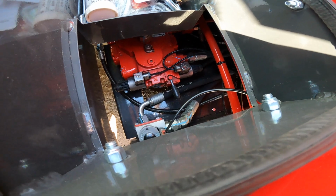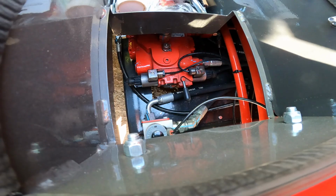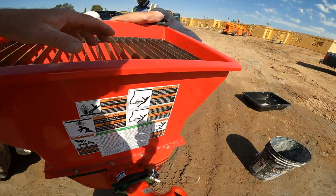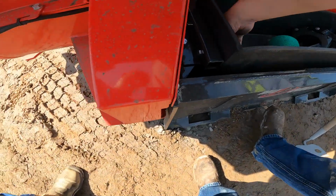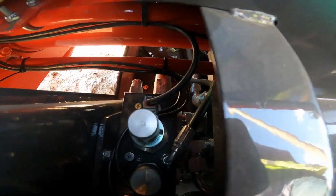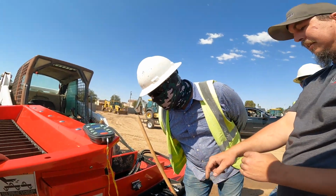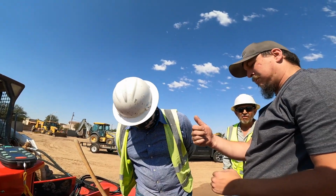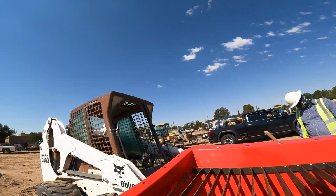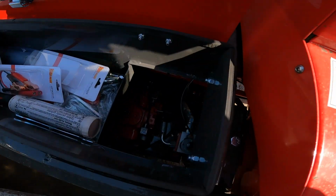But what you also have to do is the volume control, and that's done from this side. That's the thumb screw. So that's just a safety cap here. This cap unscrews right here, and it's just a screwdriver, a thumb wheel, and you just thread it all the way down, and that's wide open, and all the way back is closed. That'll allow you to run it manually without any light. So we're going over the manual valves in case your remote power or the panel quits working.